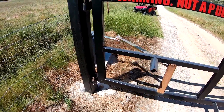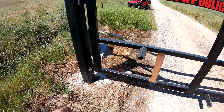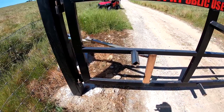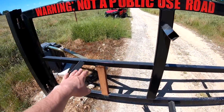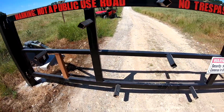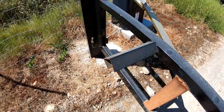We have some 750-pound gate hinges, top and bottom, with ball bearings and grease — though they sound like they could use a little more. The gate itself is two-inch by four-inch by quarter-inch wall square tubing, and I've welded all of it together. In between we have two-inch by two-inch square tubing, with structural members of two-inch by four-inch by quarter-inch square tubing.